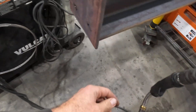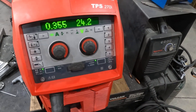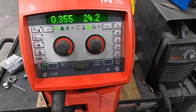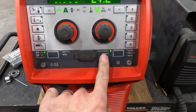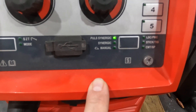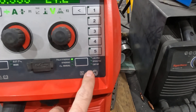I've got an air-cooled MIG gun here — just your standard 320 MIG gun. The display on this is a little different than all the other ones, and that was something I wanted to walk through. We do have auto set, synergic mode, pulse synergic, synergic manual, and also your low-spatter control and pulse multi-control.